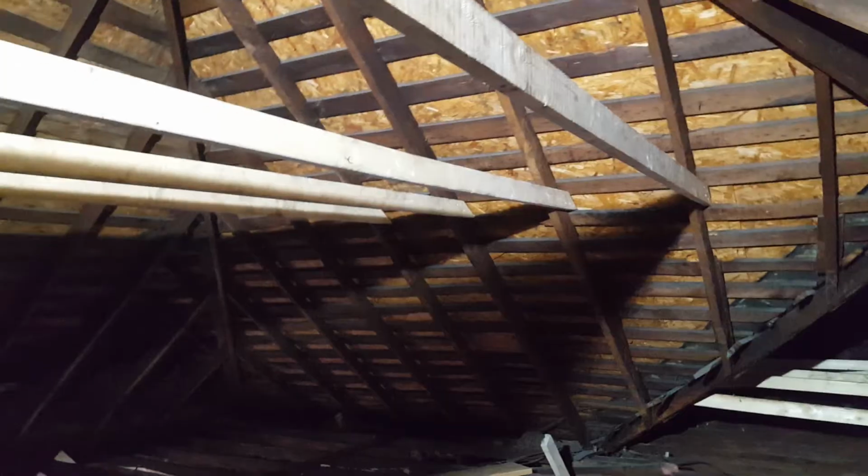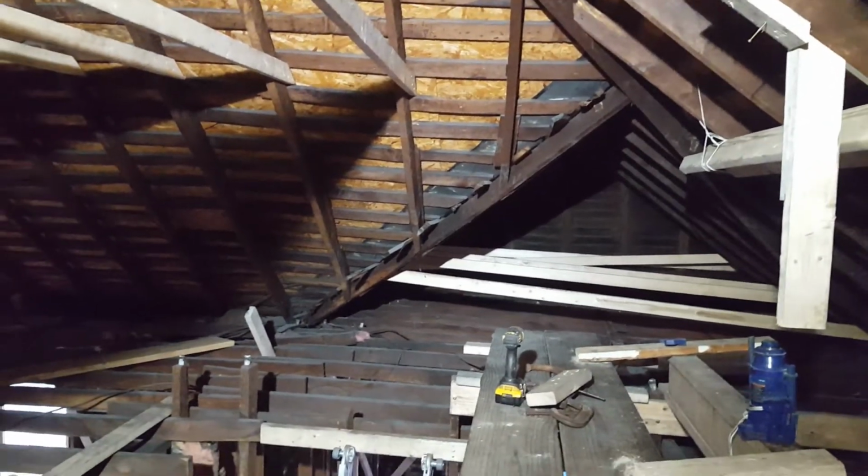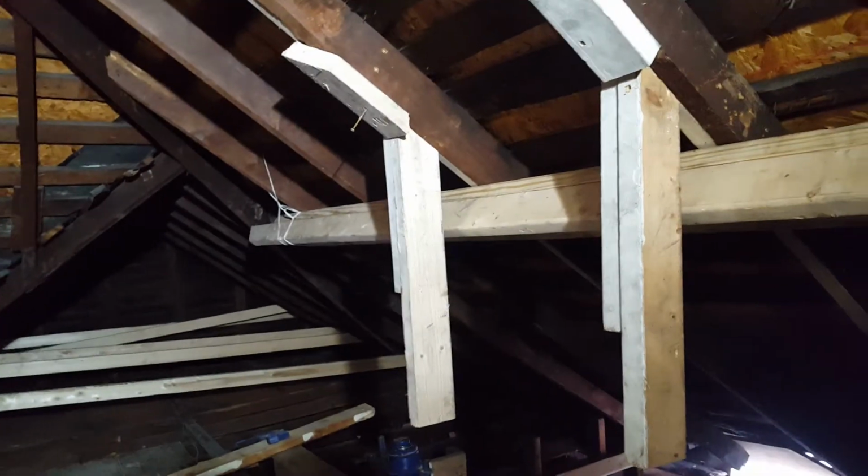It's possible they could break or pull out, but the point is to reduce the roof from spreading apart as we lift the house, as it might have a tendency to do if everything isn't just so. It's as many things as you can get lined up when you're doing this. But anyway, here's the thing that you can use to create strength, which is basically making an L bracket out of a piece of wood. I use 2x8 and 1x4 or 2x4 in this case.